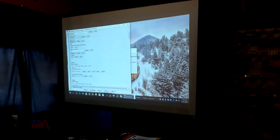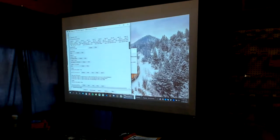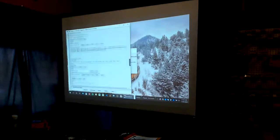I'm not using this section here, delay time, but if you wanted stuff for blinking, pulsing, debouncing, I could add that in. And here's the section for producers versus consumers. So I could create up to six events from that particular thing, like a push button as a consumer, or I could do a producer, six different events. So in this particular case, check this out. I only have one event really that's using, and what it does is it turns on or off these different signal lines. Now, how cool is that? And we'll get it. I don't want to get into the weeds of it, but you keep scrolling down here, all kinds of logic. This is where the logic for the signals comes in. Goes on and on and on.